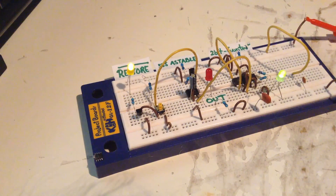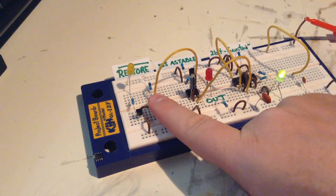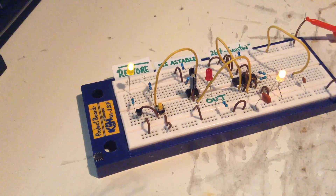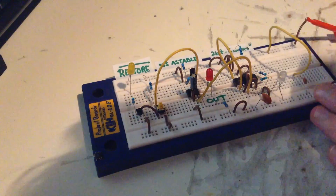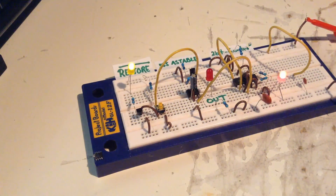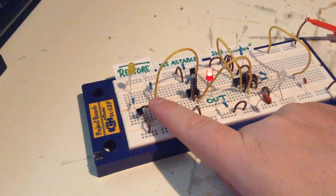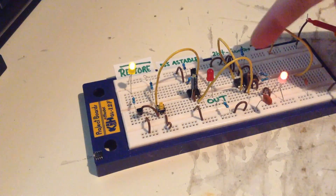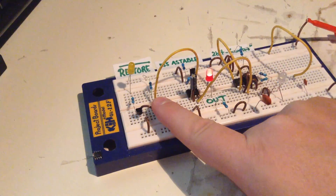Okay, not this time. So it runs. But if I switch it off and then on again, you see it starts in a random state. If we go even further and remove the pull-up on the preset — random startup. It doesn't work properly anymore. I think this preset line is so high impedance now that a change on the output will reset it, and therefore it will go to zero every other time.